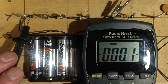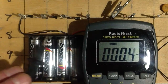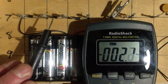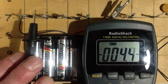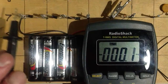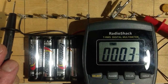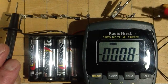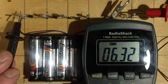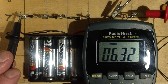Been kind of listening to some of that stuff and copying some of those signals. Took a little time off to do this video. These rectifier diodes — the cathodes are facing the negative battery terminal. You can see that black wire there. The anodes will be facing the positive battery terminal. The positive battery terminal reads 6.32 volts. That is the actual battery voltage.